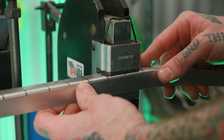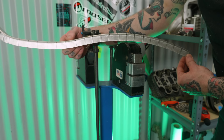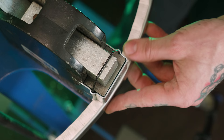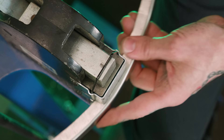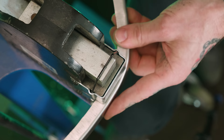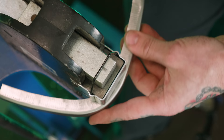The same thing applies when it comes to shrinking — slow and steady wins the race. That's how you're going to get nice consistent, evenly flowing pieces that match the shapes you're trying to achieve. You can also go full force on this thing. I'm pushing full force on a half-inch wide flange here just to show you a bird's eye view of how that actually looks and functions. You can see I'm moving material quite quickly and really thickening up that corner, so it becomes more difficult as I do so.